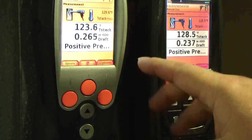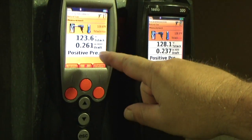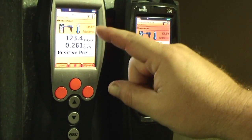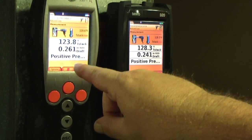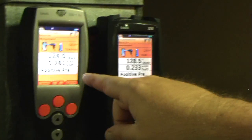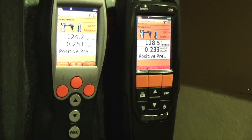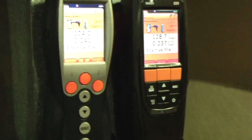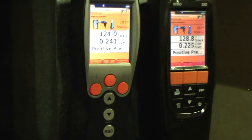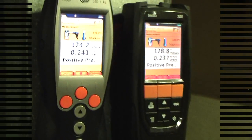If it's in that book — when we're testing a 90% furnace, should we be reading a positive pressure? And when we're testing an 80% furnace, we should be reading a negative pressure. So if we read negative right now, we'd know we have a plug. If it's positive and real high, it would tell you you've got a plug. If I had a way to block off the outside, you'd see what we'd read. I can run out there real quick and block it. Go ahead and block it and we'll see what it does.